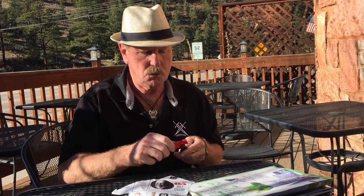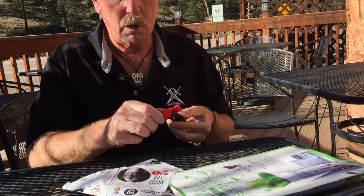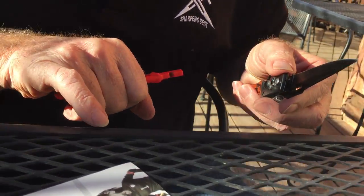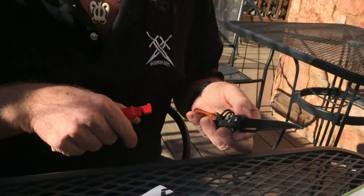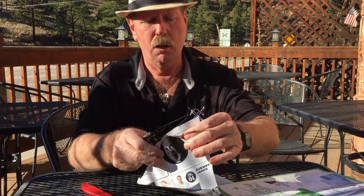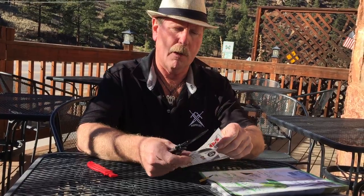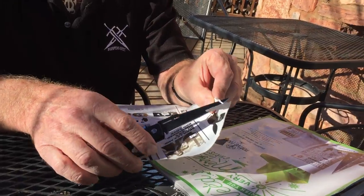We're going to quit here in a minute. Let's see if I made a noticeable change in the short time I worked on it. I can see little tiny silvery dust on the side of the knife and on the black of the table, so I know I'm cutting the blade. Sometimes you actually have to reshape the blade — you just got to cut it down. You might do it with a whetstone, but can you imagine completely reshaping a blade with a whetstone? You'd be there for two or three hours maybe. But that's already sharper than it was.